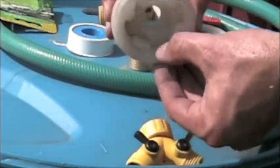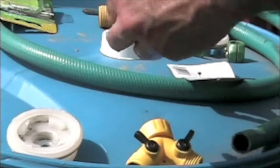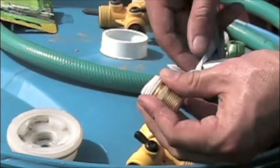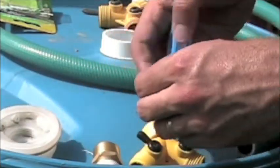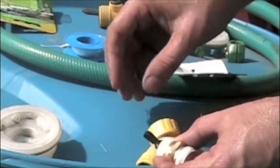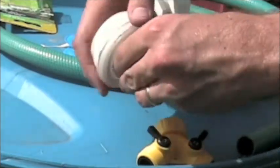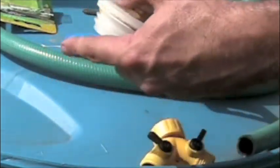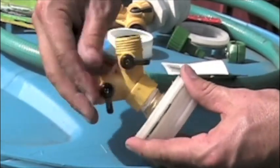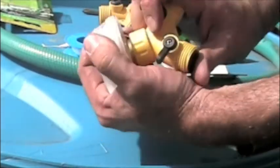This came out of the barrel. In this case I actually had to puncture a hole in that cap. Every cap seems to be different depending on the manufacturer of these barrels, so there's not exactly a one-size-fits-all. Since these are plastic parts, you really don't need to go crazy with wrenches trying to turn it too tight. What I like to do is get it hooked up, wait for a good rainstorm, and let it fill up. If it isn't leaking, don't mess with it. If it is leaking a little bit, identify where the leak is and tighten it up a little.